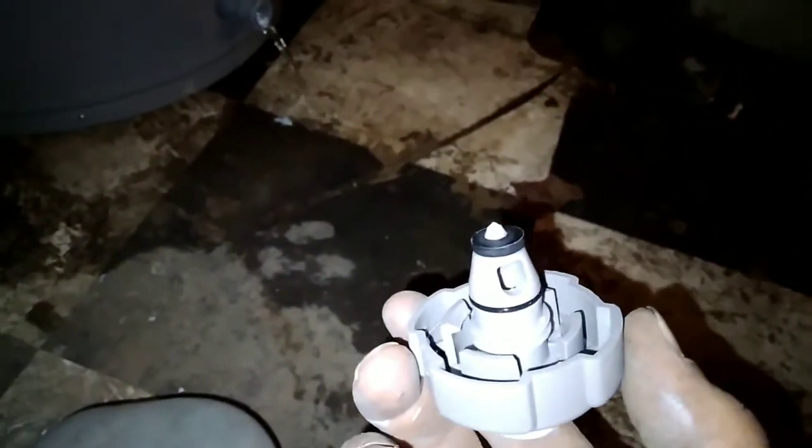It was circulating water through, but it was working really hard and spinning, just like when you plug up a fan. If I were to put cardboard on the back of this, they would start running faster. Well, that burns them out. Not only is it drawing more power for that thing to spin faster, it's working harder. It burns your pumps out.